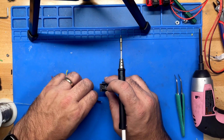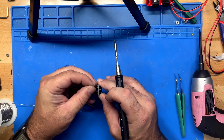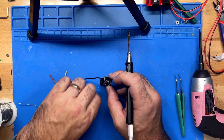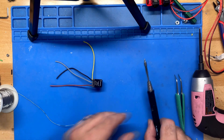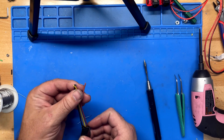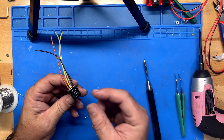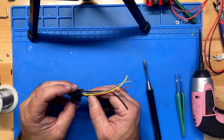Now let's go ahead and plug the wires into these holes. Looks like I got a little too much solder on that one, so we'll just heat this up and poke it on through — just like that. And that looks very nice. Now just to dress these up, we can confirm that they're all basically the same length. On my board, I actually put connectors on the end — I crimped on some pins and plugged them into headers, into the plastic shrouds, and soldered the other end onto the actual board, just to make it easier to disassemble. But this is completed.